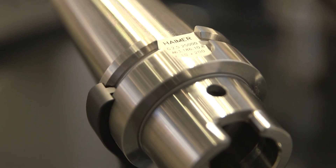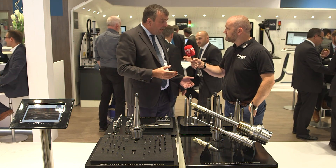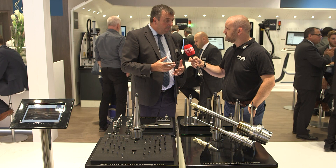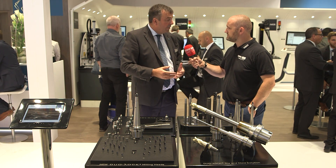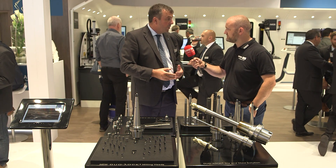For those not familiar with it, what is the big advantage of your technology? It's a lower cost option because you're not using as much solid carbide. We have very high accuracy in terms of runout, and the length is guaranteed within 15 microns — so strictly speaking, you may not need to preset if you're not chasing tolerances smaller than that.